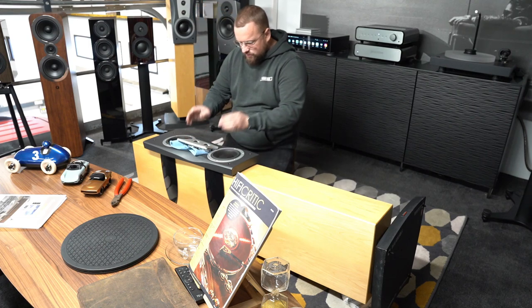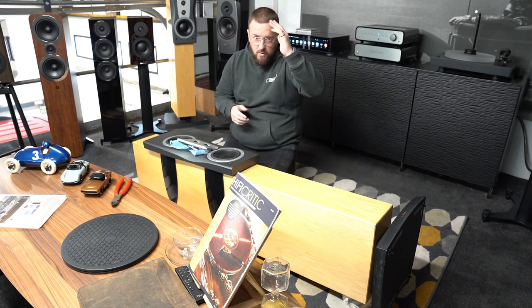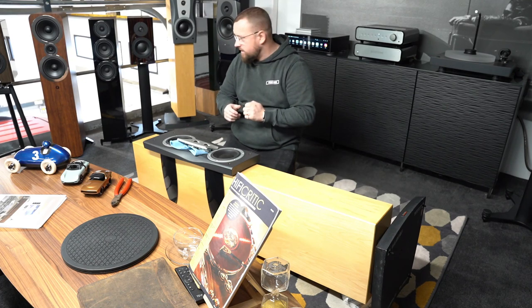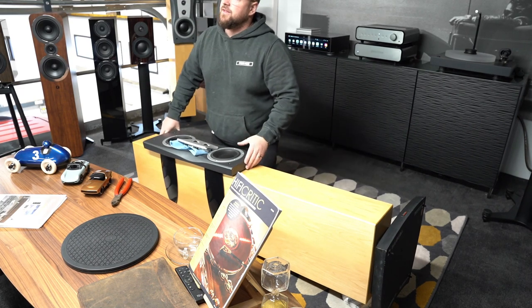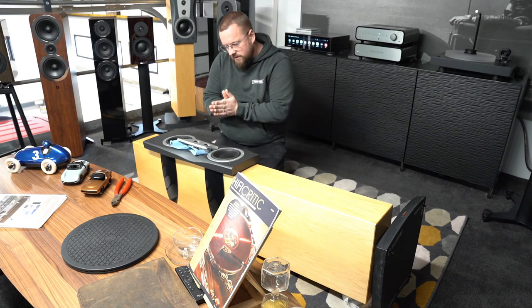So the issue: we know that we have got limited response from the bottom tweeter. The bottom tweeter is the one that plays full — all the way up. The top one plays limited bandwidth. I've stripped it apart and I've had a look at the crossovers. Visually they look fine — they never really do look damaged even when they are, and that soldering had got really hot.